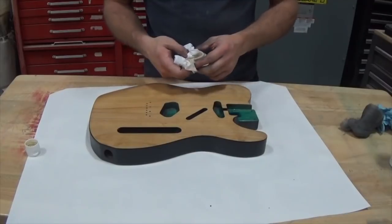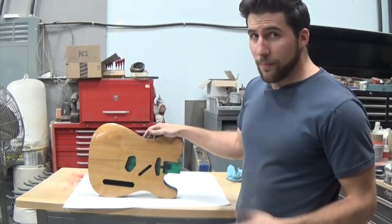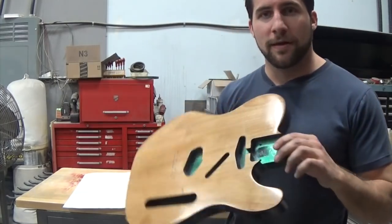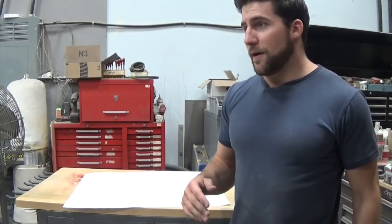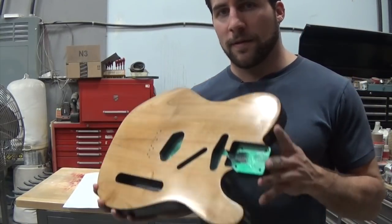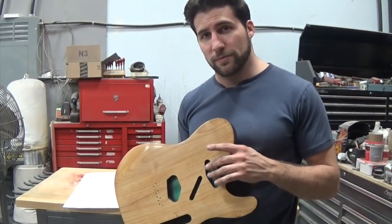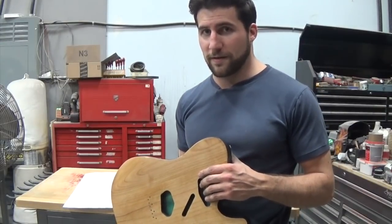That took me a while — now I know why I use a pneumatic polisher instead of doing this by hand. But it is definitely possible to get a very nice, glossy, mirror-like finish just using your hands and some very simple stuff. You don't need to buy any tools — I applied the poly with a piece of sandpaper and a cloth, and I applied the polish with a piece of steel wool and a cloth. I hope you found this video helpful. If you've got any questions, post them in the comments below. If you liked the video, please give it a thumbs up. Thanks for watching — see you next time!